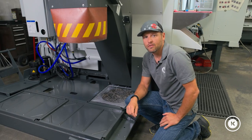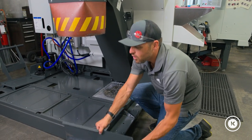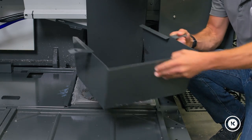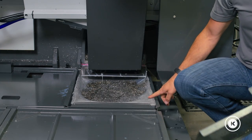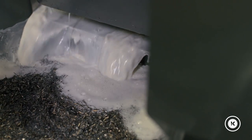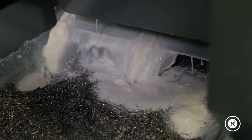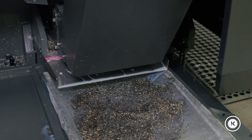Our Haas factory outlet also came up with a solution for that, and so far it's been working as well. Before, there was a big cover that sat underneath the chip conveyor with small openings for the coolant to return down into the filter mesh basket. The resolution was actually quite simple — just a fabricated little chute that allows coolant to return down more freely and allows chips to come down too. Chips are still getting in there, but you already have a filter mesh basket to collect them.